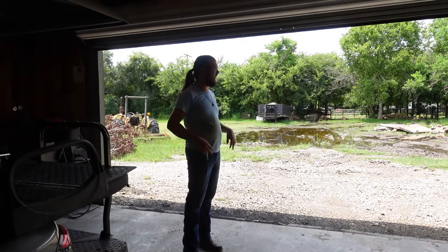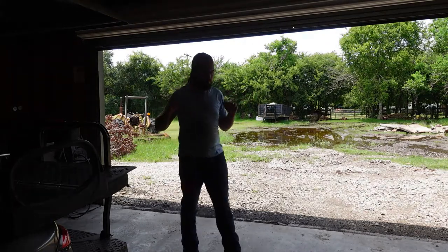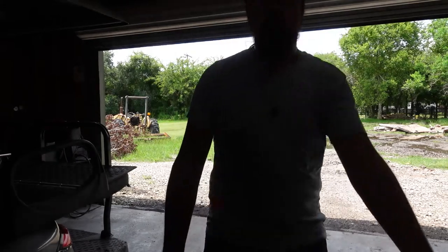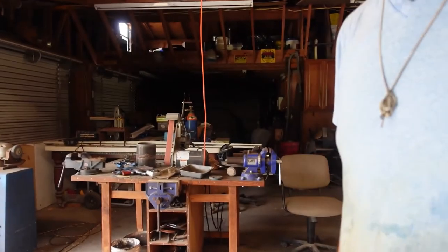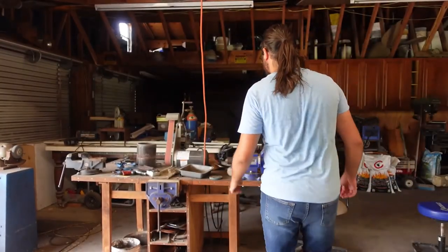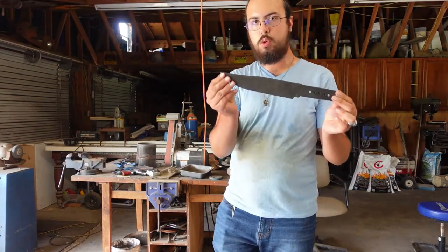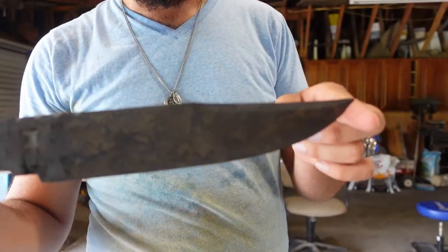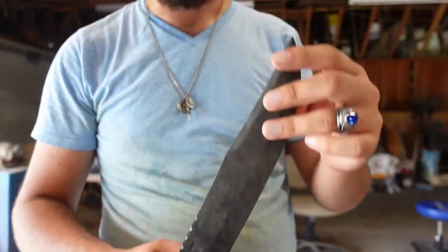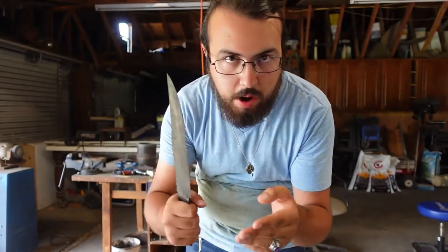Last night there was a lot of lightning. Pretty cool to watch. Anyways, forgot to film the outro bit for yesterday. However, no too big concern there. The knife spent two-hour cycles in the oven at 400 degrees each time, all nice and tempered. So hypothetically, we now have a knife that should have no problems with cracking or anything of that sort.